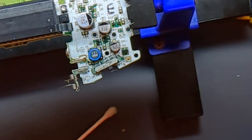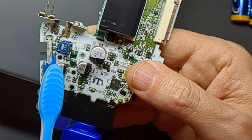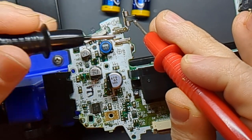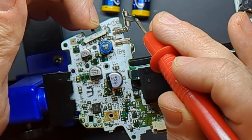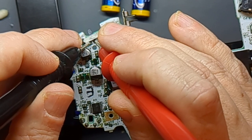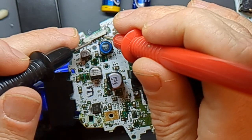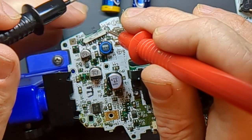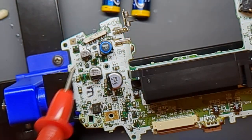After leaving the vinegar on for a little while, I'm using a toothbrush to gently scrub. The contacts are starting to come up a little bit more silver than they were. Let's check what's connected: touching this point on the spring with the connector - that's okay. In the off position those two are connected. The two middle are connected. But with the on switch - nothing happening. Switching on and checking the other connector - again, nothing happening. So we've still got a bit of an issue in terms of the connection on the switch.